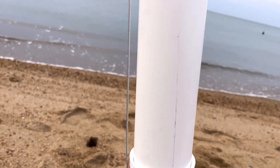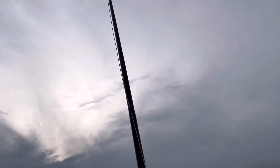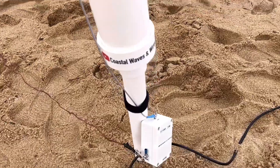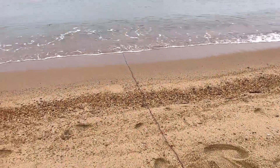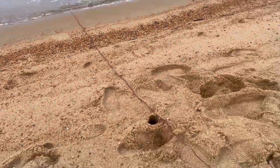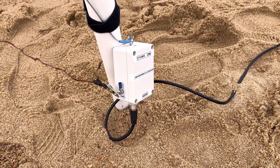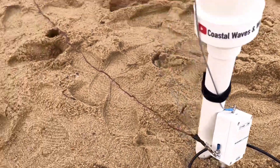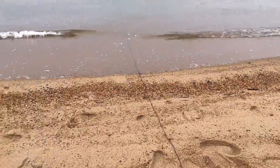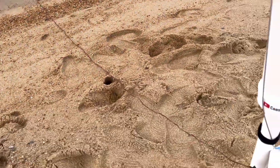Got it in my sand spike, and it is connected all the way up there to my 10-meter DX Commander pole. For my counterpoise today, I'm going with my single bare copper wire ground strip right into the water. The recommendation for this antenna is radials — basically counterpoise wires. They recommend at least four, and you get better results using 6 to 12. Obviously I've got that advantage of the salt water here, so this is my counterpoise setup for today.